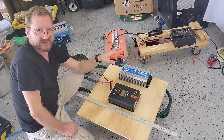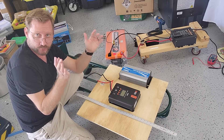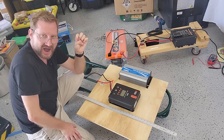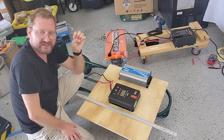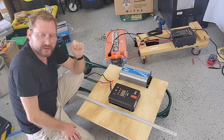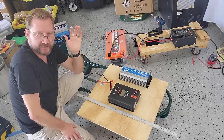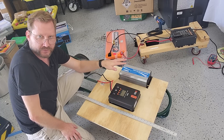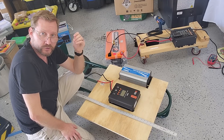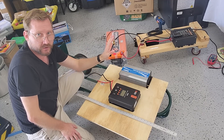The reason I'm doing a separate inverter and charger, as opposed to an EG4 or an MP Solar all-in-one, is because their minimum solar input voltage is too high — like 120 volts. That means you have to have at least four very big panels to even get them to kick on. They also have a very high parasitic draw just by having them plugged in. I can also move these components around and use them for other things. The EG4 and MP Solar are typically 24 or 48 volts, and I only have one 12-volt battery right now. So this is a 12-volt solution top to bottom.